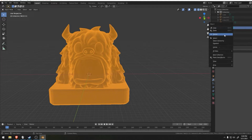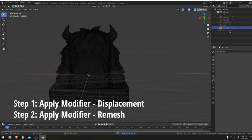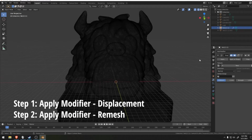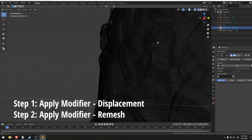The first step is preparing the 3D model of the toy to create the negative that will be used to vacuum form over. The thickness of the interior packaging needs to be accounted for when we create the negative, so the way to do this is to add a displacement modifier in Blender. This adds thickness to the model itself.